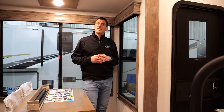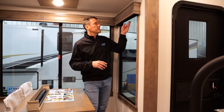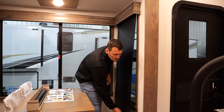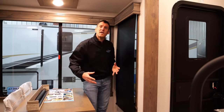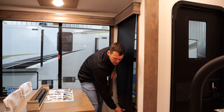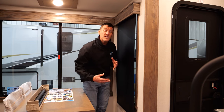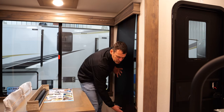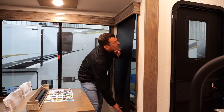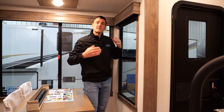One of the common questions I get from customers is: I pulled my shade down and it won't go back up. When you pull a shade all the way down you'll fully extend it. If you've fully extended it, sometimes when you try to do the normal pull down and release, it won't release — it'll get stuck. It's as simple as just doing a few sharp little tugs on the bottom of it. There's a spring up here that will release and allow it to go back up. That's the first thing to try.